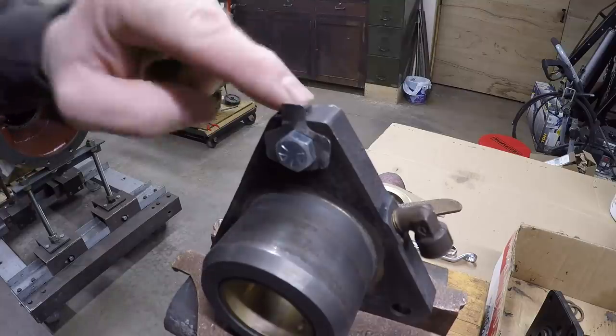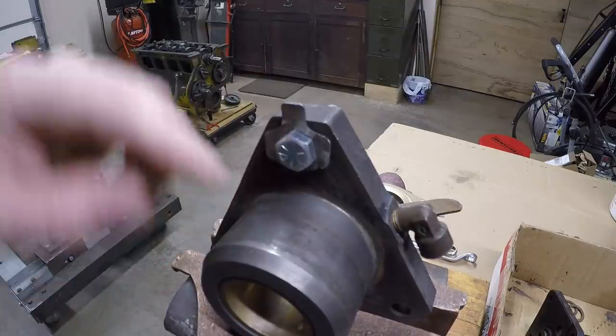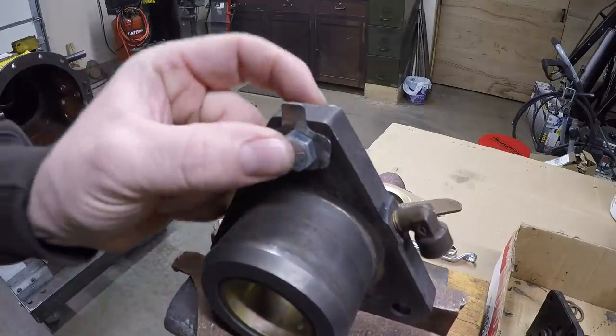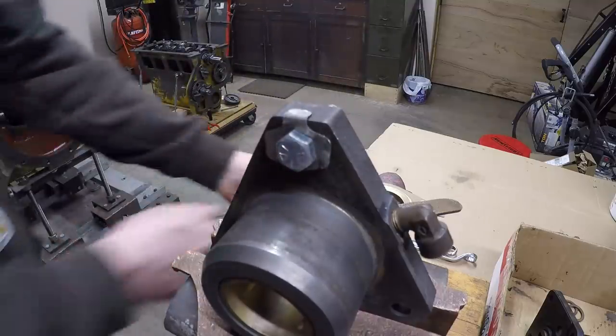For the tab that gets bent down — Michael Scruffiano asks: 'Why can't you bend the one tab first, then tighten the bolt and bend the second tab?' I've already answered it in the comment section, but I wanted to use it as a demonstration. I did indeed pre-bend those initial lock tabs that get folded down before putting them under the bolts and putting those gears in that engine. The beer can engine is saving my day again — I have this hub from the accessory drive gear from that unit to show how I pre-bent those bend-down tabs.